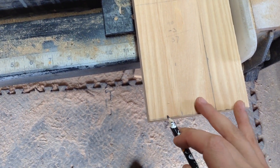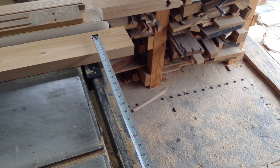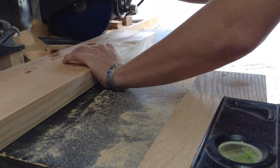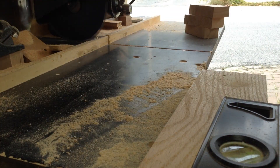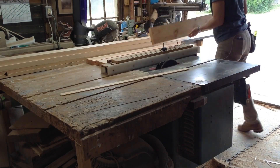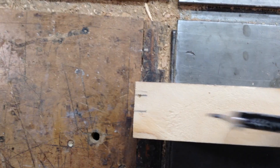You can see just how nice and flat these are after planing. For my tenons, I'm going about two-thirds of the way into my piece. I drew marks two-thirds of the way on either end of the bottoms of my stiles as a reference point, then measured between those two points and got 37 inches. When I trim the stiles down, the rails need to be made longer to account for the reduced width. The rails are a little bit thicker than the stiles — about five inches — and I wanted them a little wider than the stiles just for structure.